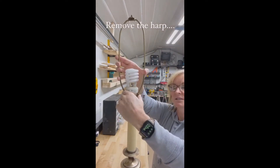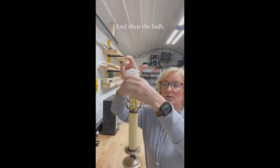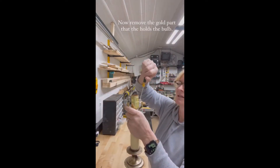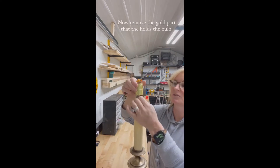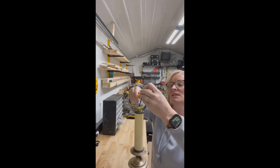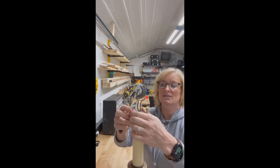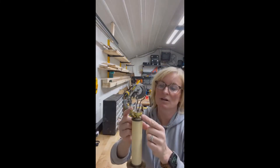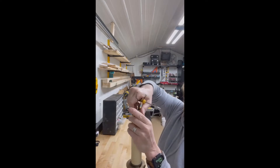Squeeze and then we have this off. Take out the light bulb. You can get a little screwdriver — it's kind of just squeezed together here. Loosen it up and it'll pull right off. With the same little screwdriver, we're going to disconnect the wires. And this little base to that socket will also just unscrew. Some of them will have a little set screw that you'll have to loosen before you can twist this off, but this one just twists off.